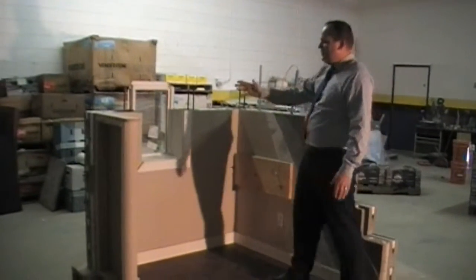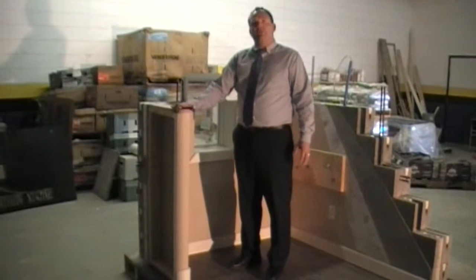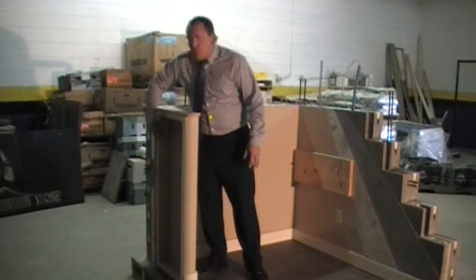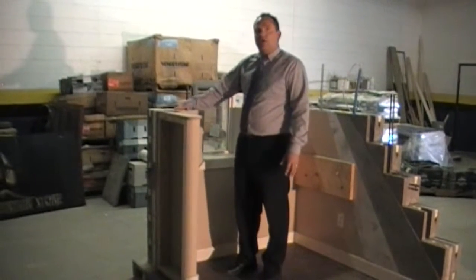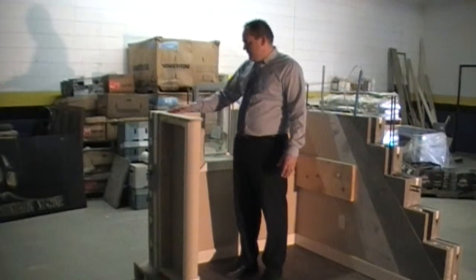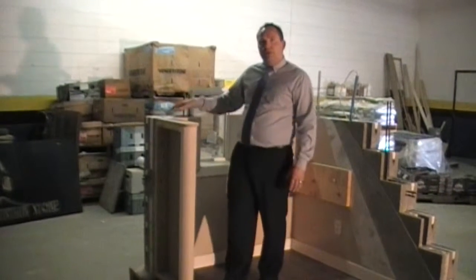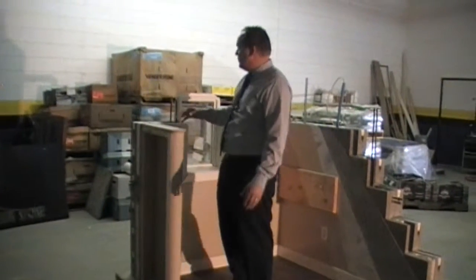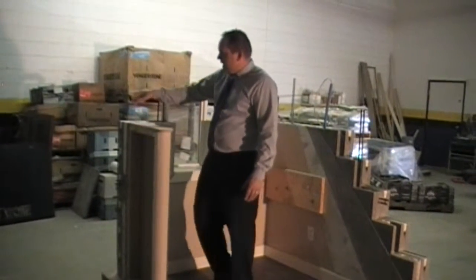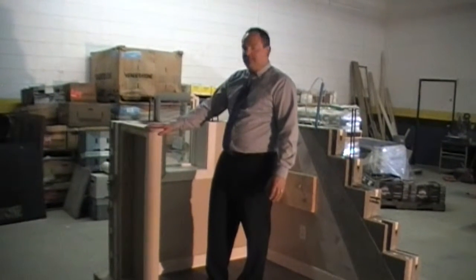As you move up, you can see over here you have an interior wall. The interior walls are still going to be stick-built — you pilot them and drill them right into that concrete block. We typically put some form of vapor barrier or poly in between to prevent any transfer of humidity or water that might be on the inside or outside, and to follow code. They build off really well and work nice and solid.